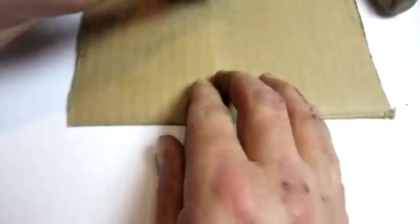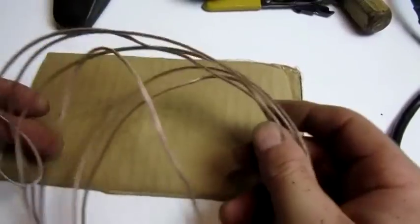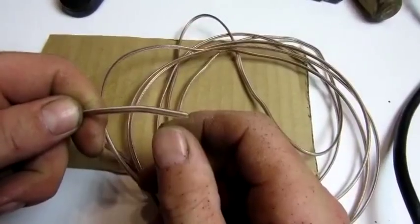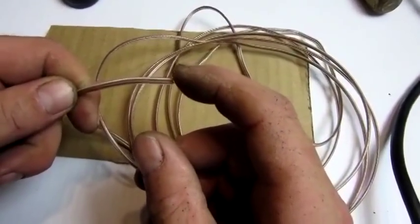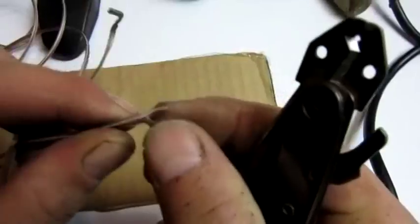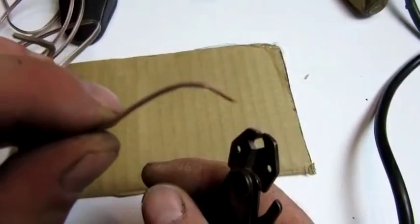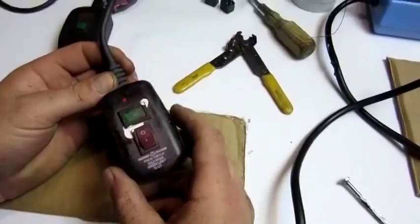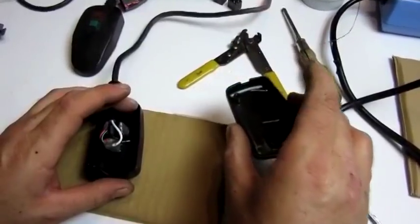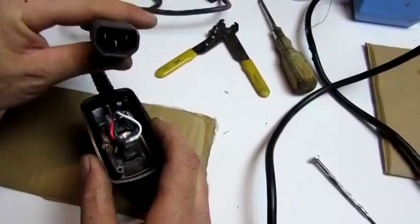When 12 volts DC is applied it will make this connection, which will be like somebody pushing the button, so your fog machine will activate when you use your haunted house prop controller or DMX. For the 12-volt wire, this is 22-gauge wire — it doesn't have to be very thick because we're only putting 12 volts to it. Take your wire strippers and split the two wires — you have a white wire and a bare wire. Strip a little bit off the end. Grab your controller, pop the screws out, and open it up.